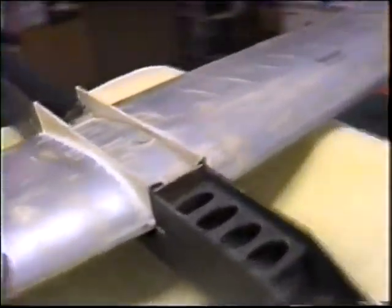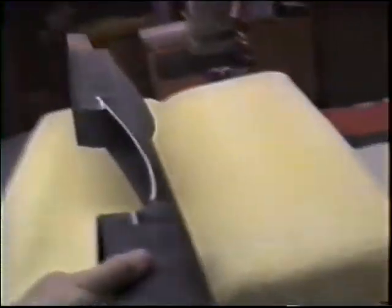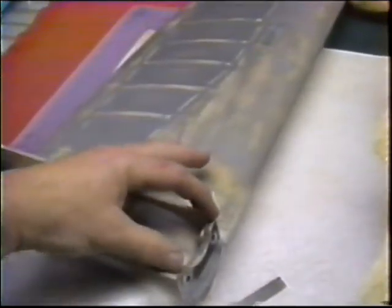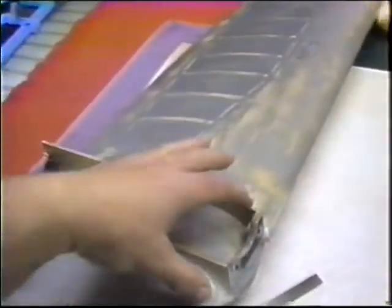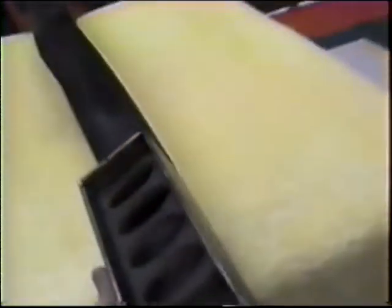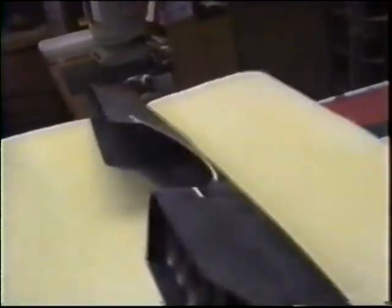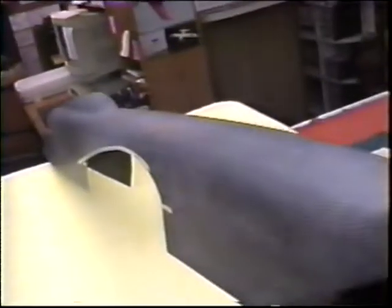One of the things this is going to allow me to do — and I didn't plan it this way — is to use this fuselage, which is narrower than the other one, to basically make another airplane. What I'll have to do is, when I make the wing, make the top part wider to the wider dimension. Anybody that knows me knows I'm not going to just let it not match up. If this were a wood fuselage, imagine the hours of cutting and carving and sanding, but in our case it's not a big deal at all — we already have the shells molded up. So I'm going to go upstairs, get the shells, get the crutch, and get started on it.